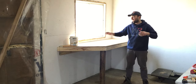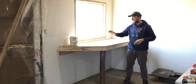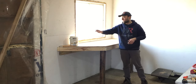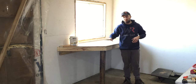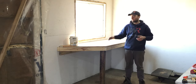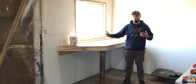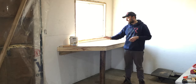As the workbench sits right here, it's basically done. The base frame is done, the legs are done, and the 3/4 inch plywood as the workbench top is also screwed to the frame. The only thing left is to apply this lacquer finish right here. I'm choosing it because it's pretty durable against oils and other detergents I use when cleaning. I'll be applying that tonight, in a well-vented area, since I don't want to be in here while it dries.